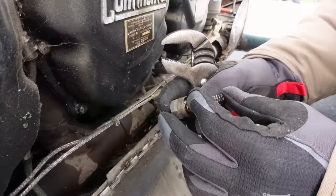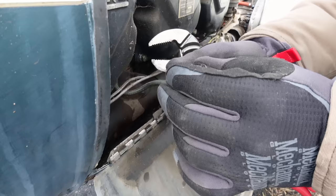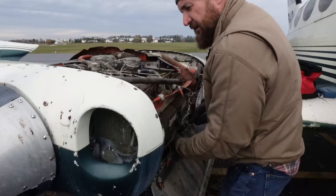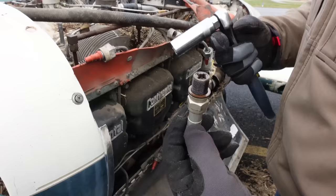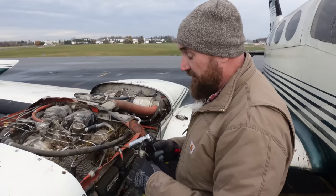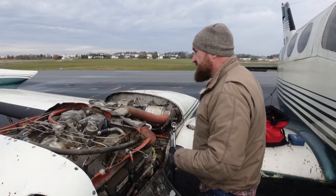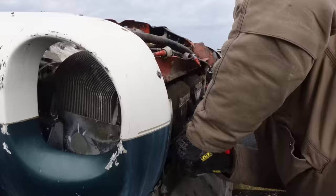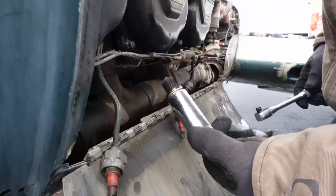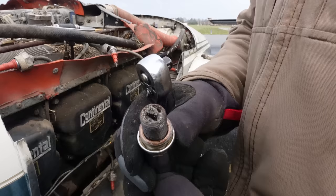It's trying to clean the carbon off this spark plug lead, and it pretty much disintegrated. If you look at this one, it's the same way. So these wires may not work — to see if we can get this to run, we may have to replace the wires. This one actually has oil in it. That tells me one way or the other there was oil in the cylinder — maybe this cylinder had some weak rings. The last time it was run it left some oil in it, so this cylinder will probably be the only one that's not rusty.